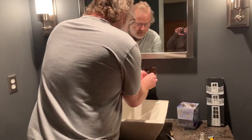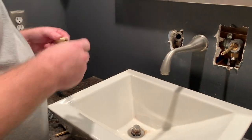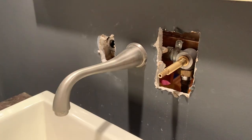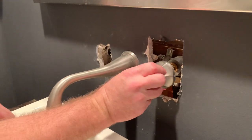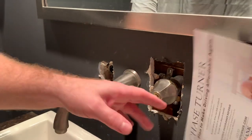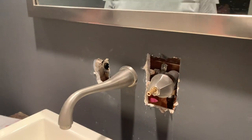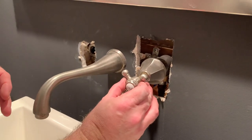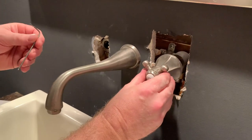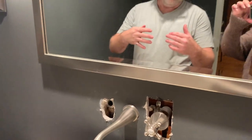Now let's go inside and see if we've got the right length. I'm going to put this in finger-tight for the moment since I'm not turning the water on right now. Let's put on the all-thread — finger tight. Then let's put on the escutcheon. A little simple trick: put a piece of paper against the wall until it's flush so I know when to stop. There we go — flush against the wall. The handle fits right on. You want a tiny bit of gap because the handle moves and the escutcheon doesn't, so you don't want it flush against the escutcheon. We have the right length and everything is cut. Next I'm going to prepare the drywall, do a patch to cover it up, paint it, and then put everything back in place.